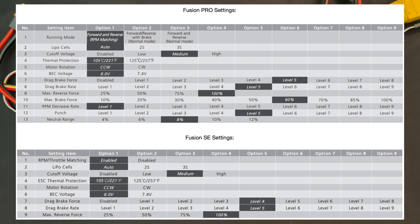Both use the same low, medium, and high voltage cutoff mode. Low is right around 3.3 volts per cell; medium is close to 3.5 to 3.7 per cell; and high is above 3.7 volts per cell. The reason it's not exact is because it depends on battery condition, the plugs you're using, how hard it gets discharged, temperatures, and more — so you'll get some variance. The default setting of medium is pretty safe, usually landing close to storage voltage. If you want more run time, run it on low. If you're using nickel metal hydrides, you can disable the voltage cutoff entirely.